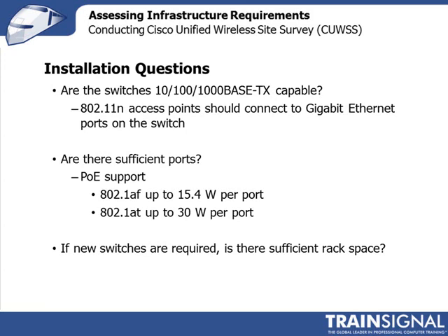The second thing we need to do is make sure there are enough PoE ports to support all of the access points we want to deploy and connect to that switch, and to make sure those PoE ports provide power at the desired level. You'll find that many times when you do a new 802.11n deployment or an upgrade from a legacy to an 802.11n deployment, the switches need to be replaced. It's a very common occurrence and a very common thing that's overlooked.